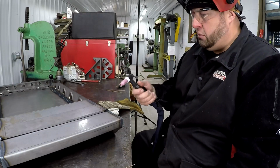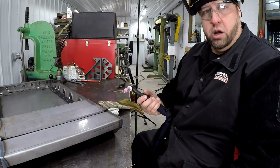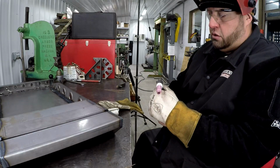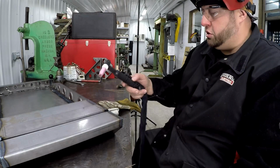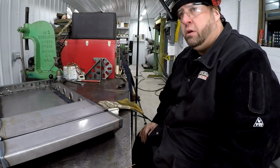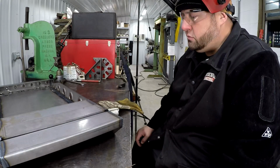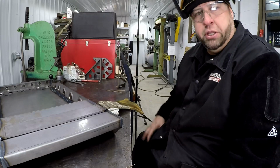That's all I'm doing. But we've done quite a bit of welds on here, continuous welds too, and so I haven't gone over the duty cycle yet. We'll just let this cool and do our stitch welds, which is going to pan out probably for my gas bottle because I'm just about out of gas. I've been trying to run that bottle empty before I go and exchange it. So I think I got enough to do these bottom stitch welds here,